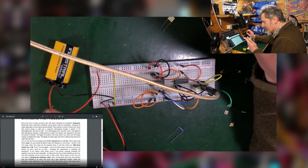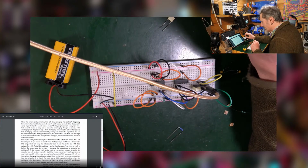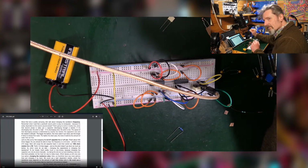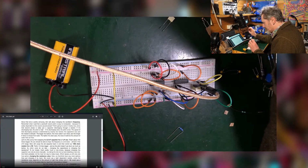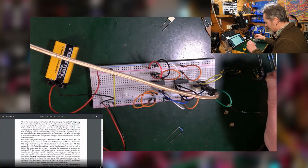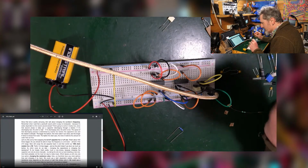So which route do we take? Changing the capacitance or changing the resistance? Well, it's pretty much a non-choice because changing the capacitor can only be done manually. Well, what about a flux capacitor? Anyway, by taking the old one out and installing a new one. And it's not the most fun way to make music. I don't know, I've seen synthesizers that come with capacitors that you jam into things. Which leaves us with one option, changing the resistance value.